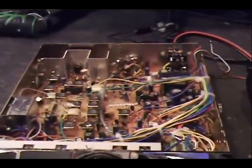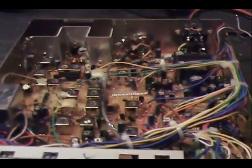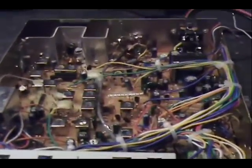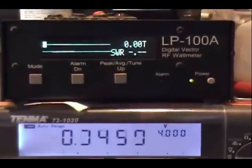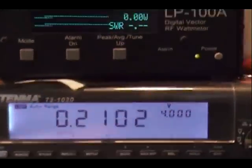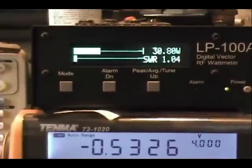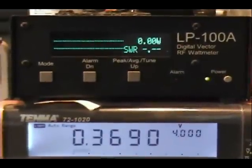We did a quick tune and we're back. We went through a standard tune — let's check the dead key. It's now at five point eight seven. Wattage on audio test: thirty point eight watts just with me talking, so it came up. Just normal Cobra, that's about right.